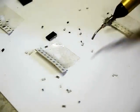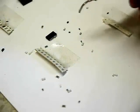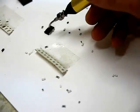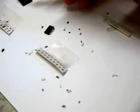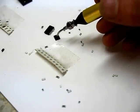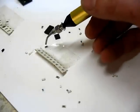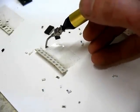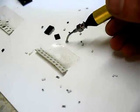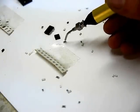The stock tip is actually pretty big by surface mount standards. It's good for larger packages like these surface mount MOSFETs — it picks up big stuff like that. The smallest it really works well is about size 1206, which is about the size of — a little smaller than — a grain of rice.